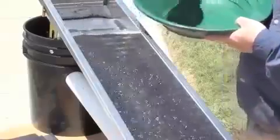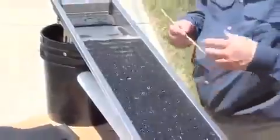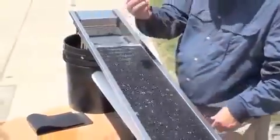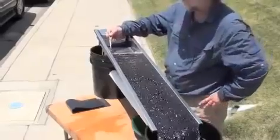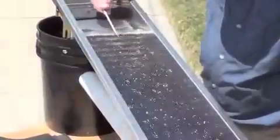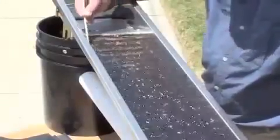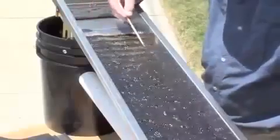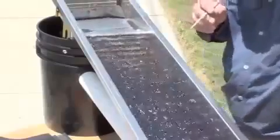So I keep my fingers out of it. The only thing I do is if I'm running really heavy material, I go back to my chopstick. I run the chopstick from the edge to the center on about the top four ripples just to make sure we still have that fluid material moving, because those are the most important four ripples in this operation.